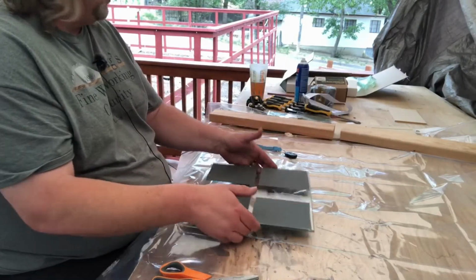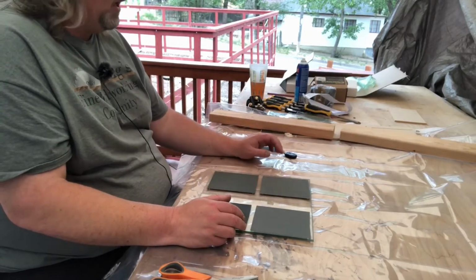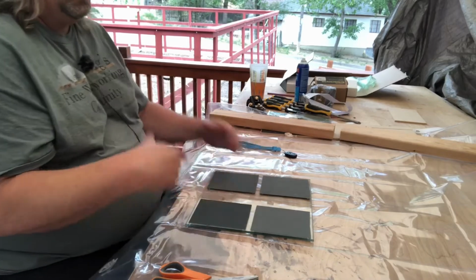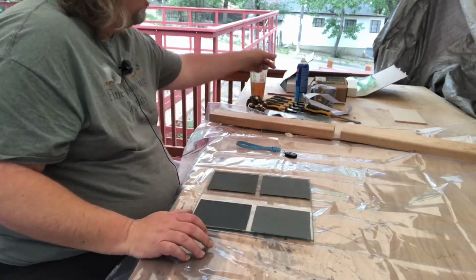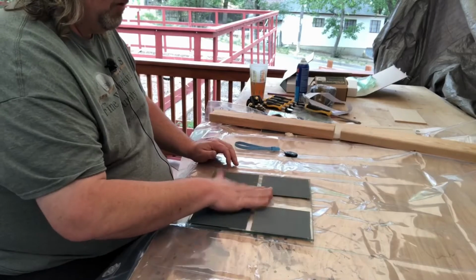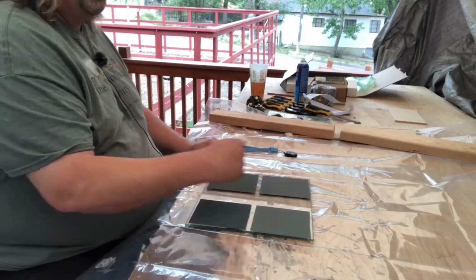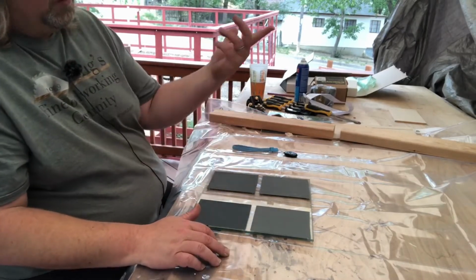Now I'm sure a lot of you are asking, why don't you just use the regular wet dry sandpaper you have and spray the adhesive on it and then put it down? Well, from my research and understanding, that spray adhesive over time will build up and it's hard to get off, and it's hard to get everything back perfectly flat, whereas these self-adhesive ones don't leave a residue. You can just pull them off and toss them and replace them. That's my understanding. We're going to find out.